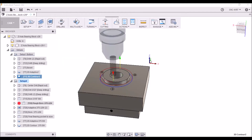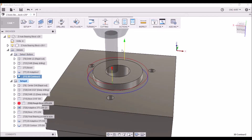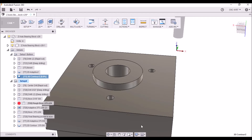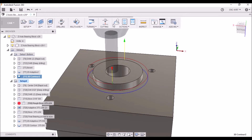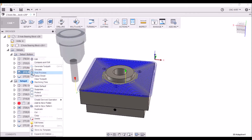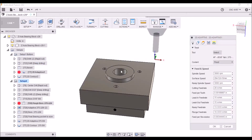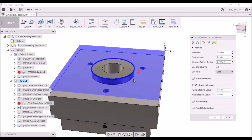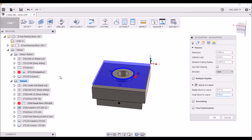The next operation is coming back to finish contouring. I ramped this down, and when I actually ran the g-code the ramp was only at 13 inches per minute — it can actually be at the feed rate, it didn't need to be slower. We're just cleaning that up and it goes around the part for a final pass. When I set up the adaptive clearing, I left stock on this radius so I could clean it up in that finished pass. The radial stock I left was ten thousandths.